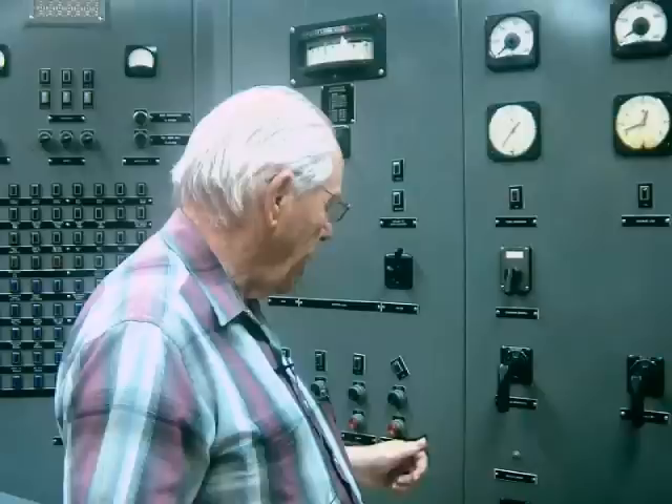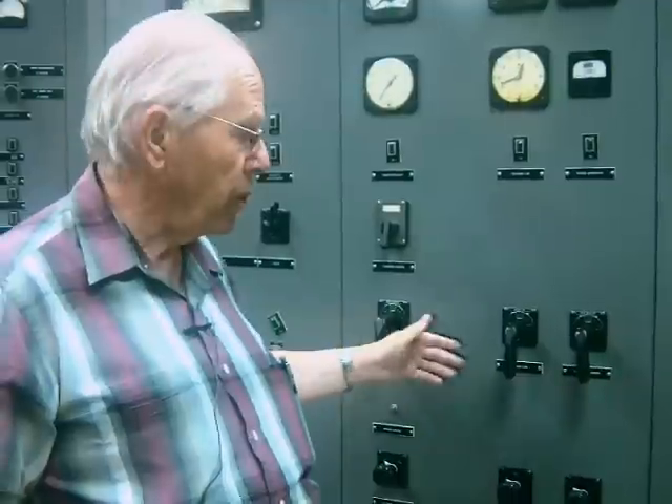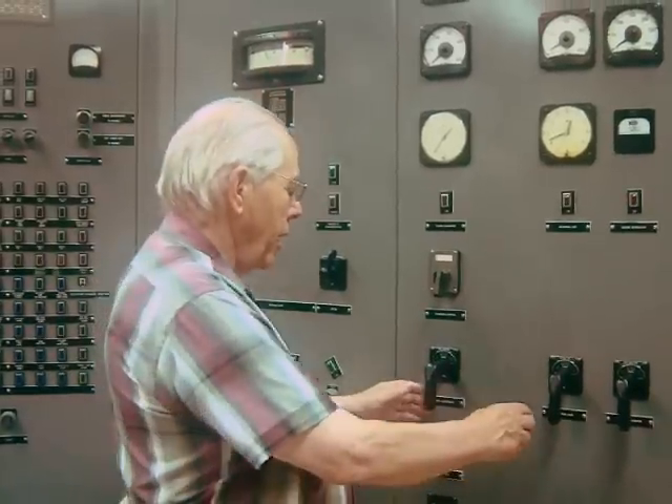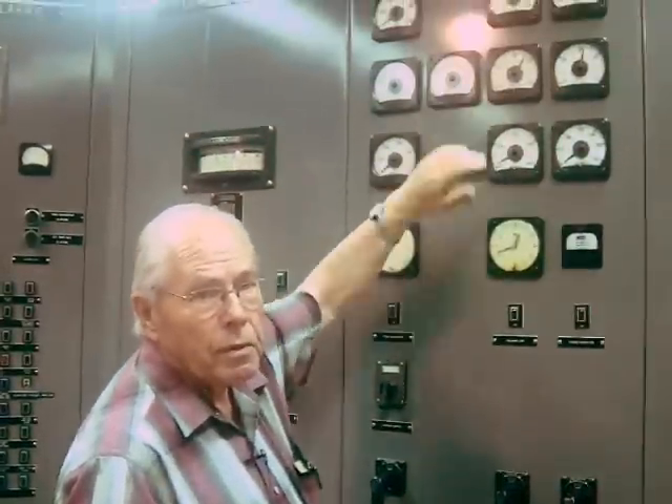When you got up to power, it would take a couple of hours for the heating system to get the steam system going. If we came here in the morning and cranked up the reactor, it would be nearly noon before we'd get the generator going. Then there's more attention over here where the controls are for that. You'd crank up the generator from out there, but here you get indication of the turbo generator. Here you'd see what our generator is doing, and here what the incoming line is doing — you've got to merge those two together. This synchroscope tells you when you've got them right, and then you close this line.